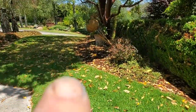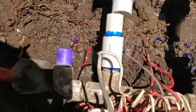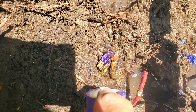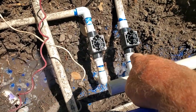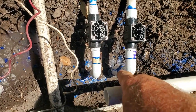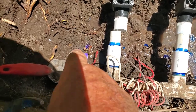The shutoff valve over there at the well — the handle is closed all the way, but water is still barely seeping through and coming out. Least path of resistance. Before I removed these valves and had these cut off, the water was coming out at the lowest spot, which was down there. Once I got those valves on and had cut this assembly off, now the least path of resistance was right here.